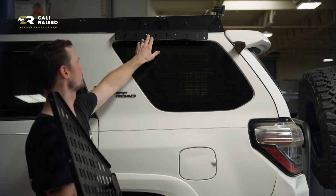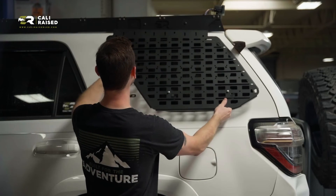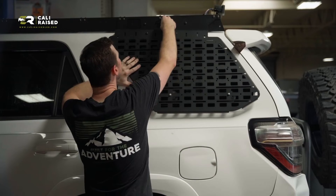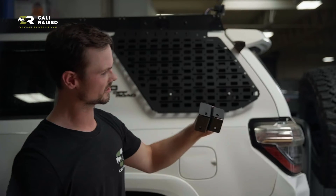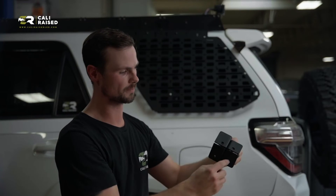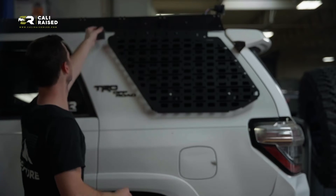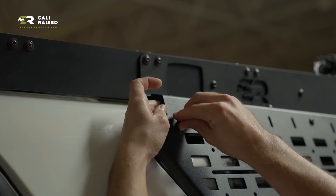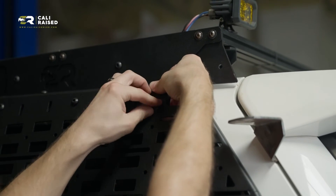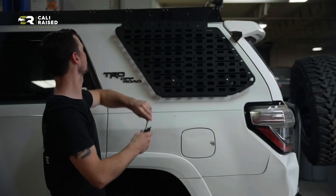We've got our nice light panel. You can see there's two holes here that have threads on them already, and then there's one up here. We're going to attach those first, and then we'll use our gussets and attach the side ones. So just lay this up here and get them more or less in place, then start getting these screwed in. There are two different gussets: one long, one short. The long one goes towards the front, shorter on the back. The holes are quite different — these holes go up towards the top, these ones on the side. The flange will go towards the inside as well. Slide that underneath, then take our 3/16-inch Allen and finish tightening them up.